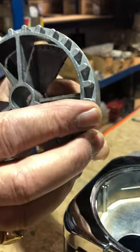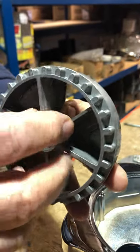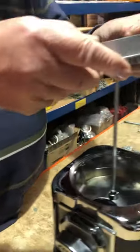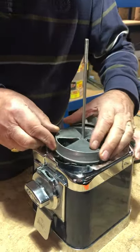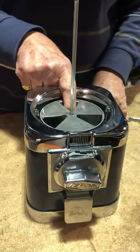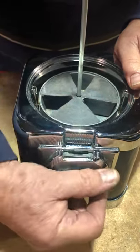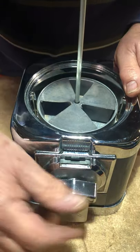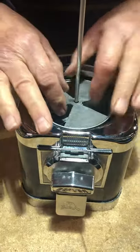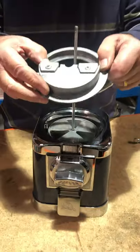The lower the setting, the more sweets you get, so I've set it at one. If I set it at five, the hole reduces to a smaller size and I'd only get four or five sweets out. But if I do it at one, I'd probably get ten sweets out of the same hole. Also important: the wing has to be at 12 o'clock. If you don't do it at 12 o'clock, you can flick sweets out without putting any money in, because you'll have two holes exposed. So you must set it at 12 o'clock.